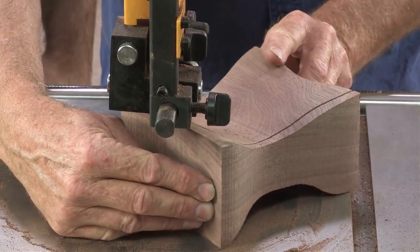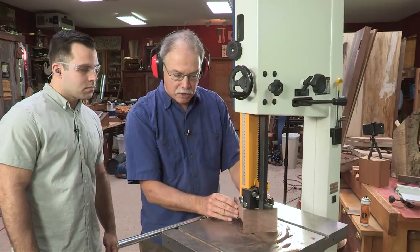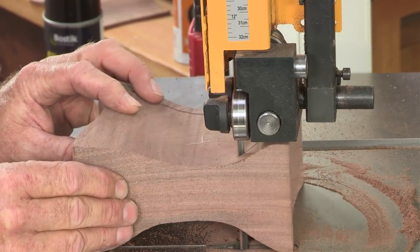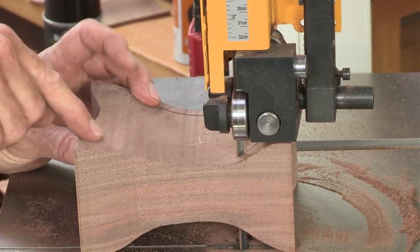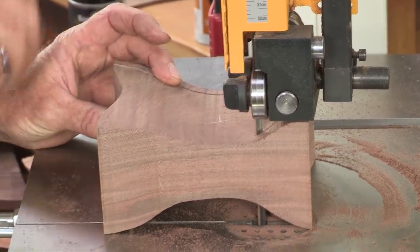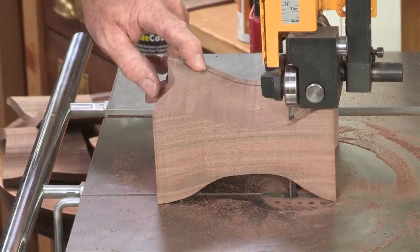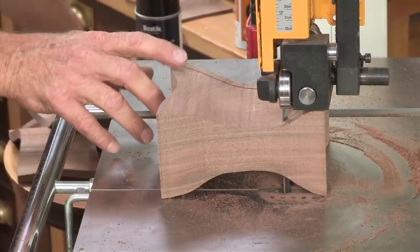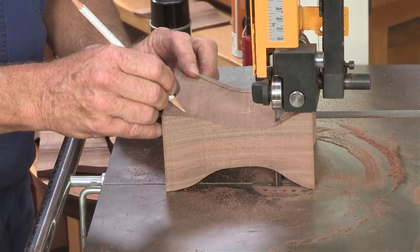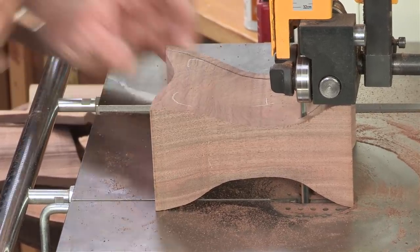I'm going to make one more turn here — it's okay to put some real torque on that blade to walk around that bend. Now I want you to do the same thing and come over to the entry cut. When you get here, I'll stop. Don't back out of the cut when it's running. End with a radius coming back into the entry — a little bit more open on that deep side.